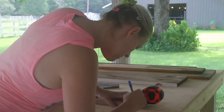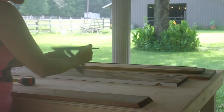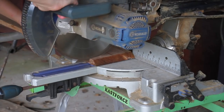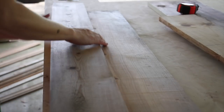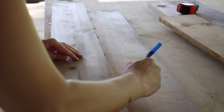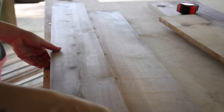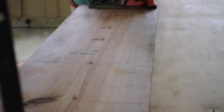I'm going to start out by making the legs of my fireplace first, so I want to do my two posts. I'm using one by six inch boards and they're going to be cut to 53 inches tall, so you'll actually have three side pieces for one post. Since I didn't have all of the one by six inch boards, I had another board that was one by ten and I just ripped that in half until I had enough pieces to complete both of my side pieces.